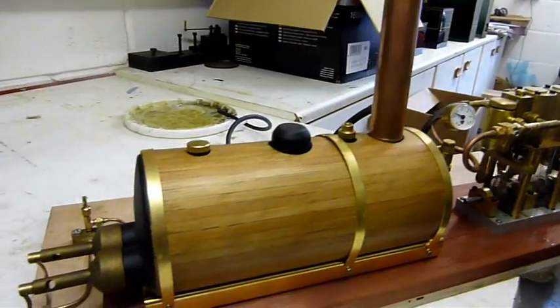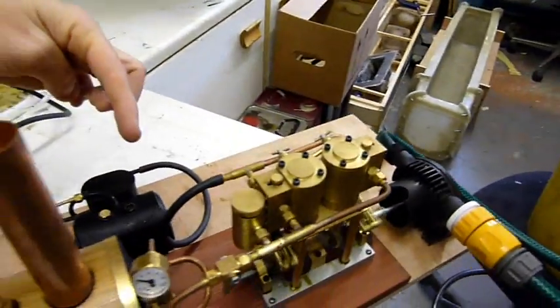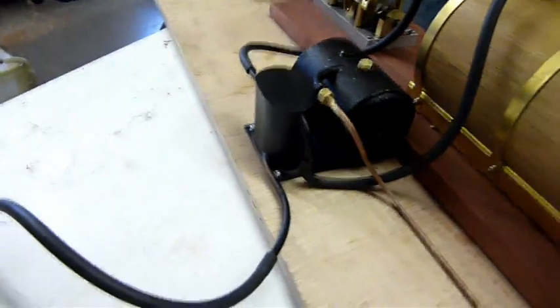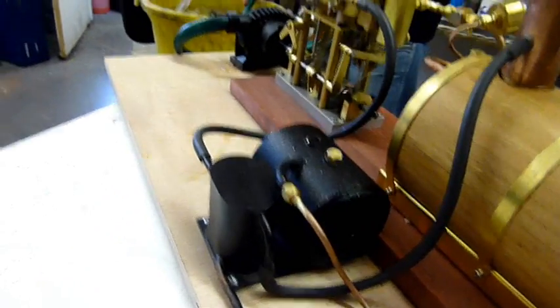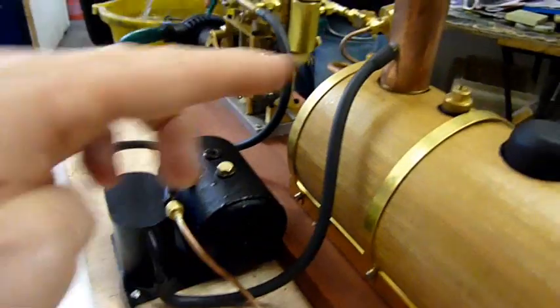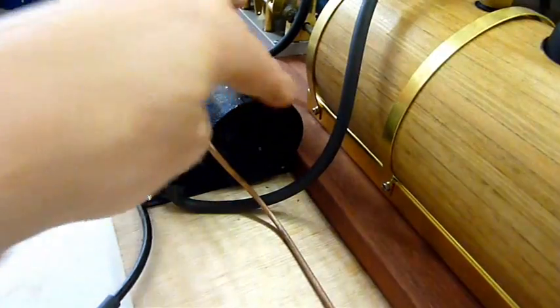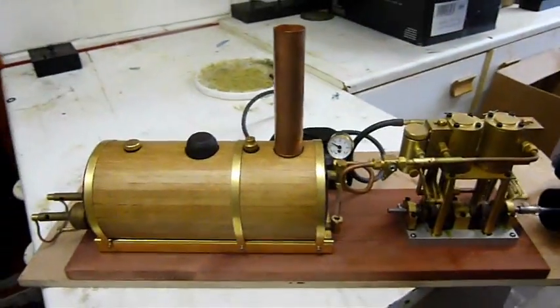So the steam gets made in the boiler, runs through these pipes, in through the engine, runs the engine, back out through the exhaust, through to the separator — which takes the oil and the water and all the rubbish out of the steam. Then the steam gets recycled back up the chimney. The separator gets nice and warm, keeps this gas tank warm so it doesn't freeze up. And there's all your oil and other rubbish coming out the separator — in a boat that would stop it going into the water.